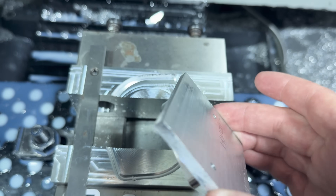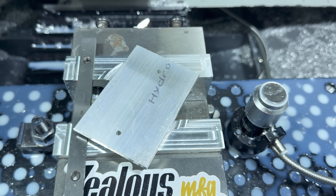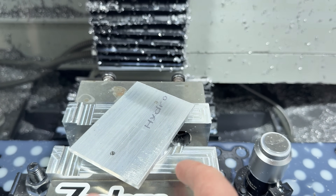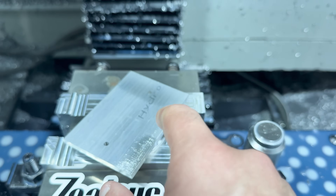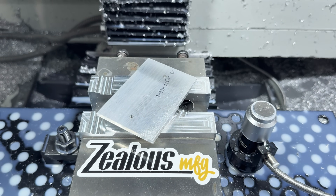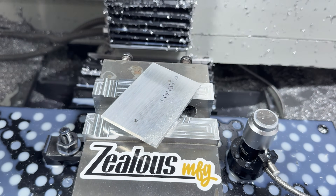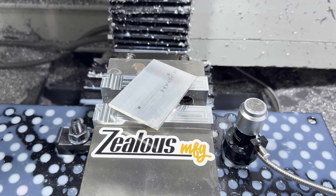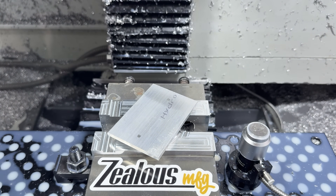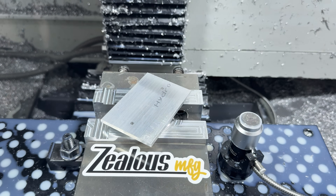The item sits kind of like that. Here you can see the item is in there, probed off that hole and off the base — the bottom machine surface on the fixed jaw. So now we'll rough everything out, we'll leave stock to the bore. Then I take one of the items to see how it's a snug fit, and once I get it just where it starts to push in but kind of locks up, I'll take it out, freeze these, and press them into the item.